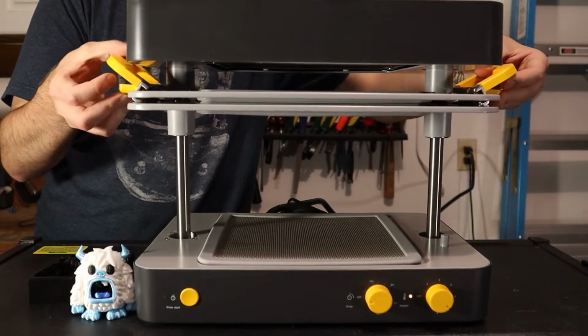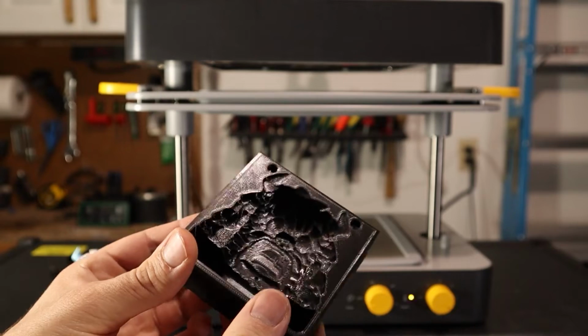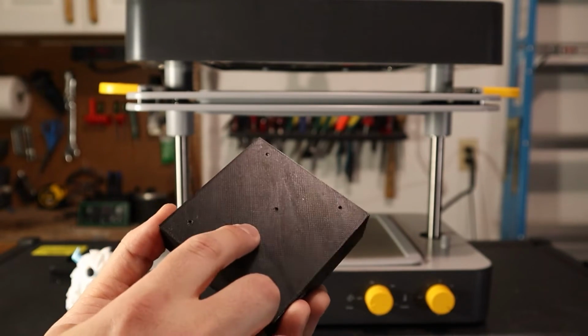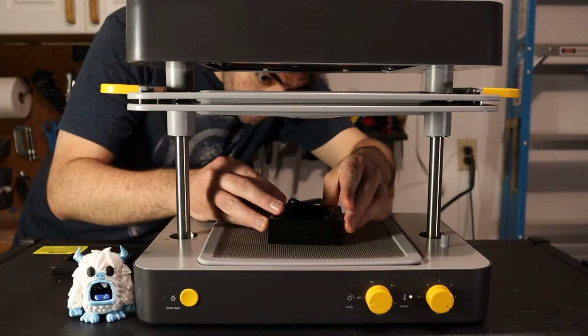I forgot to add these during the modeling step, but I think drilling them out worked just as well. You're going to want to add some holes along the interior of the buck. I just used a small drill bit and made sure to add holes at all the deepest parts to ensure the air would be sucked out properly.